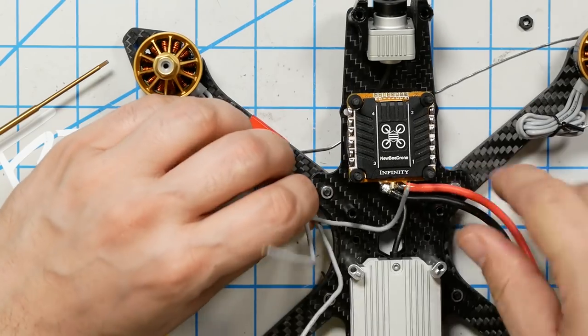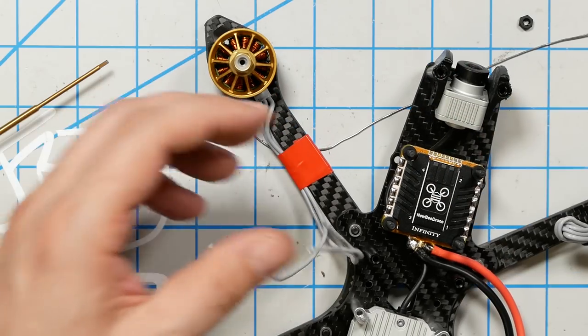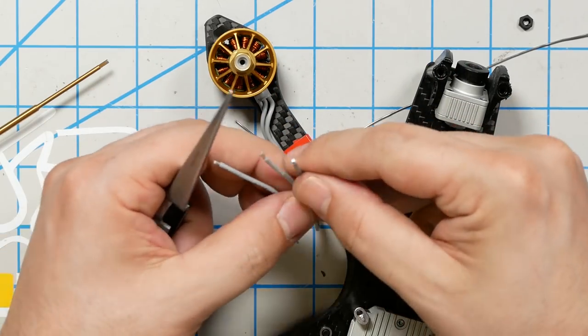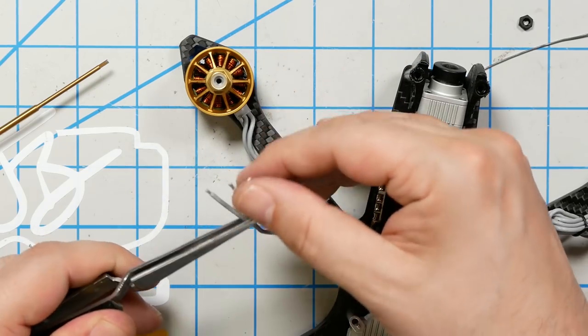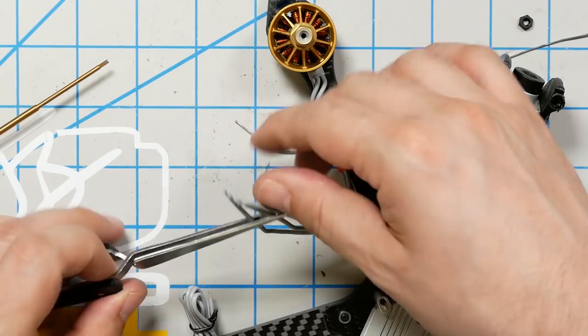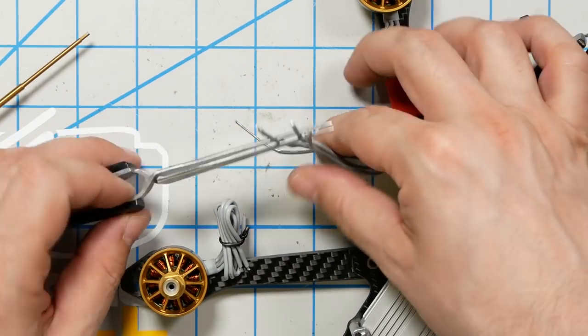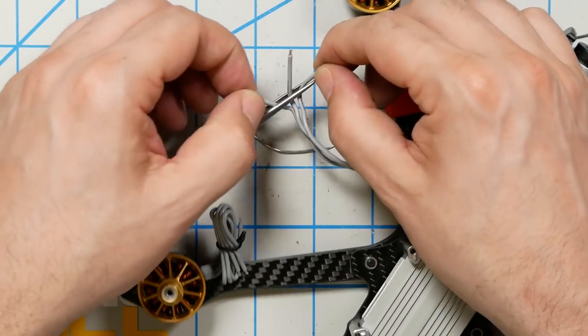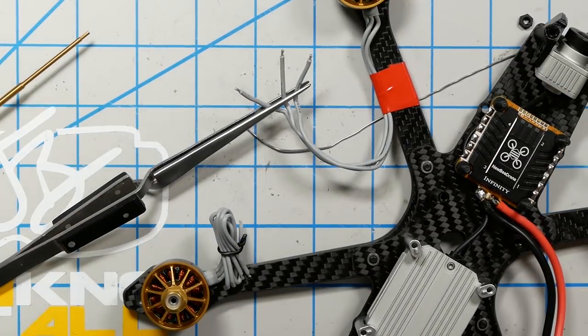Hey guys, Joshua from the future here. The Newbeedrone flight controller comes set for reversed prop direction by default, not standard prop direction. If you intend to keep it that way, then you would need to put the wires on the front of your arms, not the rear. If you do decide to use standard prop direction, put the wires like I show them here, but then when we get to the check motor direction part near the end of the video, you'll need to do standard motor direction instead of reversed.